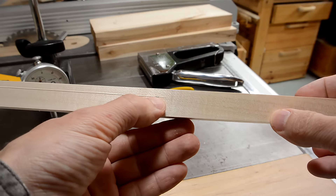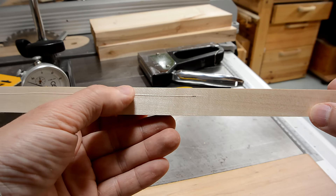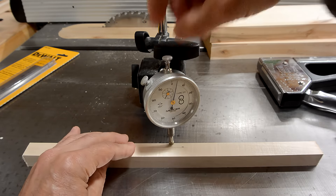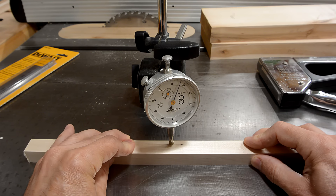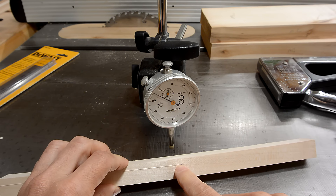The wood is nice and smooth here and right where the staple is we have this ridge that starts — it's a pretty good-sized nick. Very narrow but pretty deep. Let's check this with a dial indicator. As I move that wood across, that needle goes up by more than 5 thou, or more than 0.1 millimeter, just from that one staple that I cut through.